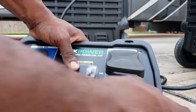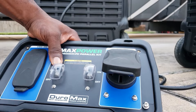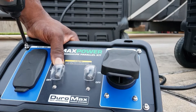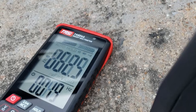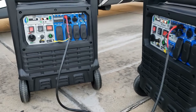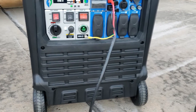We did verify that on the Duramax there's no neutral wire, but you still get your 125 volts. It would be kind of hard to use a surge protector on this one because you can't have any open circuits. So you do get 125 and you do get 250, you just don't have a neutral. That means the one neutral you have is your ground - if that ground goes, everything goes. But with a neutral, you have that backup.